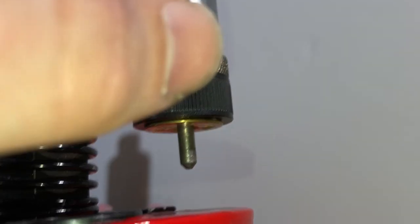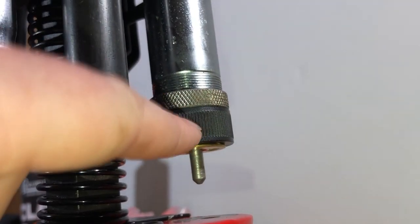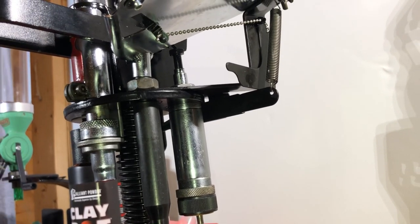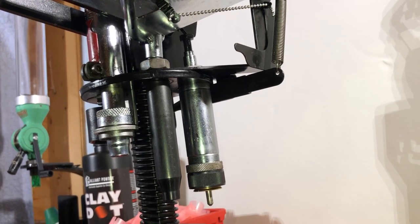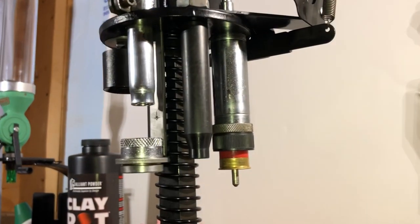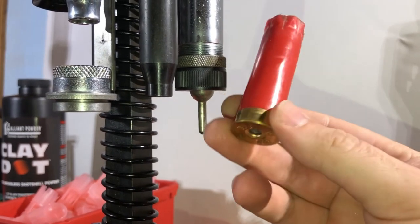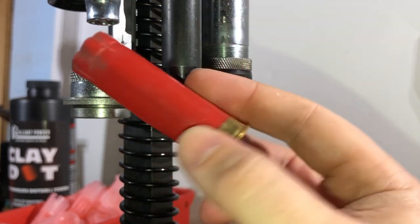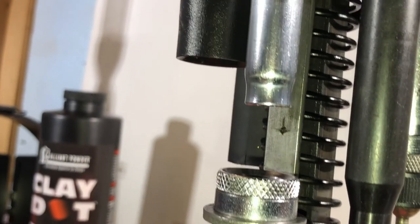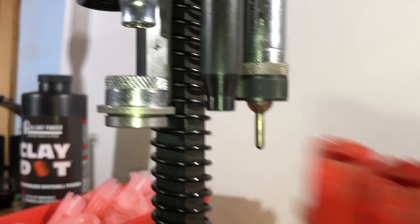When the hull is raised all the way up, the top portion of this decapping assembly has an expander designed to open up the mouth of the hull so you can reload it and make it easier to get the components in. As I raise up on the handle, it's pushing down on that bolt head and simultaneously forcing the hull out of the base of the sizing die. If you do this quickly, sometimes they'll pop out — it depends on how much they needed to be sized. You can see how it's sized the base of the hull and we also have the mouth opened up a little bit, comparing that to a non-sized hull. You can see how it's smoothed out the previous crimp.